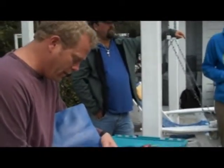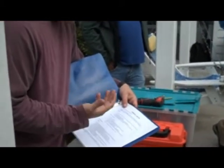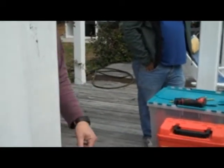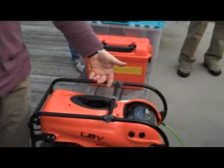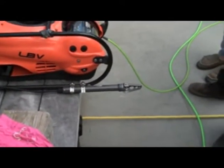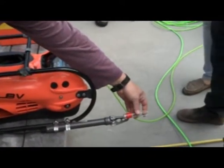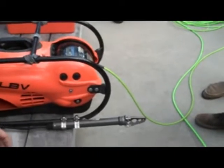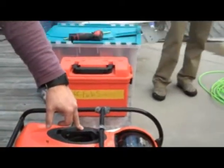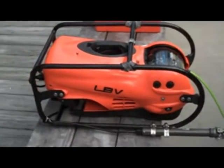So right now what we want to do is go ahead and turn the monitor power on and the actual power to the ROV. A couple people stand out here. We're going to check the tilt, program the manipulator arm open and close — when we open it, slide these on so the angles are pointing towards the center. We'll also do the thrusters — your vertical and your horizontals, as well as your aft thrusters, which are also your horizontal thrusters.